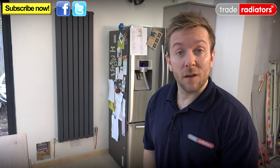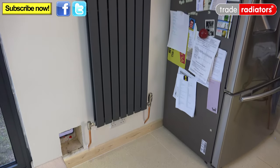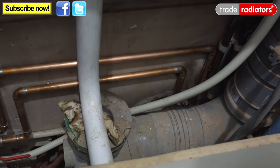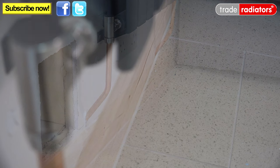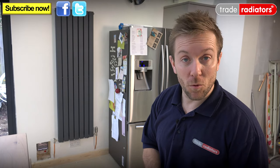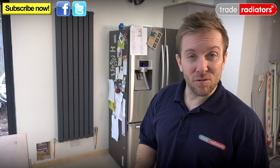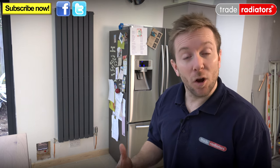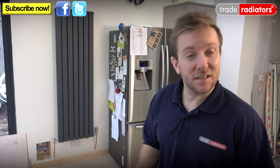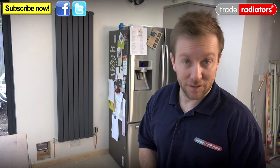We're going to use some builder's mate around here, then paint our pipes the same colour as the wall at the back. All done — the radiator is nicely installed. All I've got to do now is decide what colour to do the skirting board, or whether the customer wants it varnished. The way we've run our pipes through from the existing system, making use of that skirting to hide the pipes, looks really good. The anthracite matches the doors and windows in this house, and we've got some nice decorative valves to finish it off. I hope this video has given you a better idea about why you might want to install a radiator in a kitchen even with underfloor heating, and also how possible it is — with a little bit of planning and foresight, you can put radiators in almost any part of the house. If you need any more help, please visit traderadiators.com. Thanks very much for watching, bye bye.